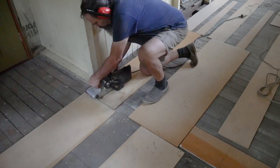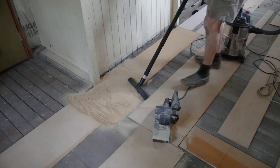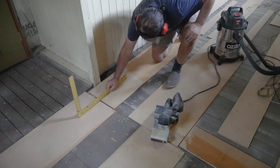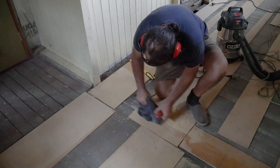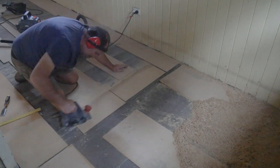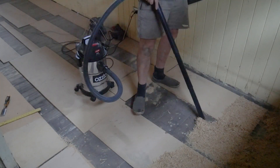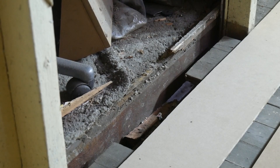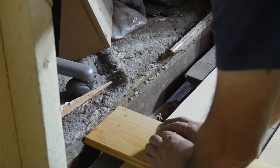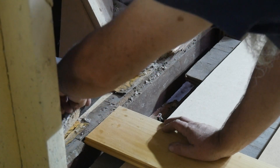We then get into those parts that need to be brought down a bit with the big belt sander, which makes a bit of a mess. This is easily cleaned up with the industrial vacuum cleaner and is necessary to check the levels of the floor. For the middle, we found an electric planer removes material a lot faster, though it creates a whole lot more mess — fine shavings rather than dust, which are more difficult to clean up. We test with a short offcut board to see how it lines up, and it lines up beautifully.